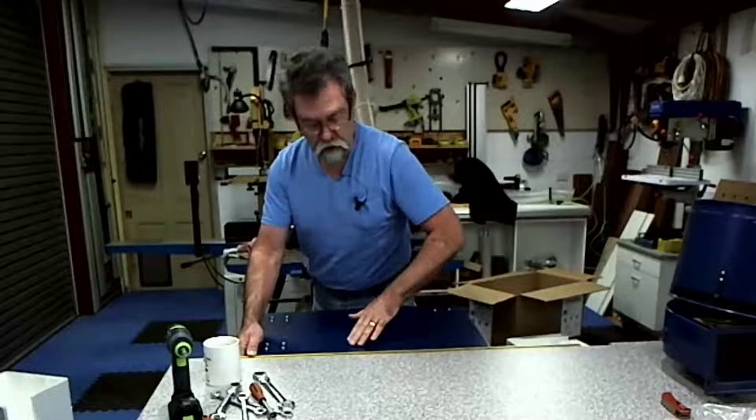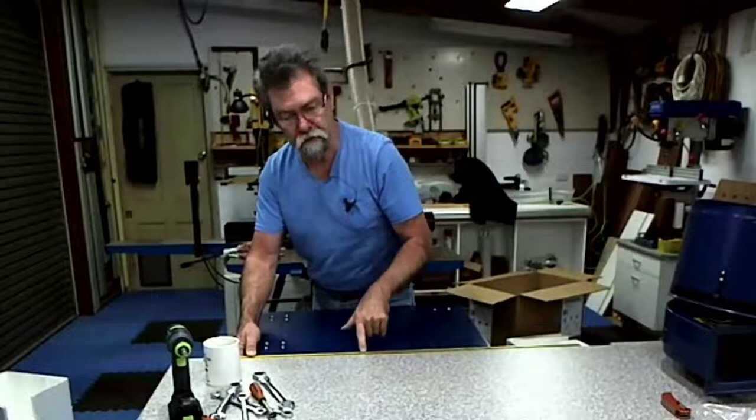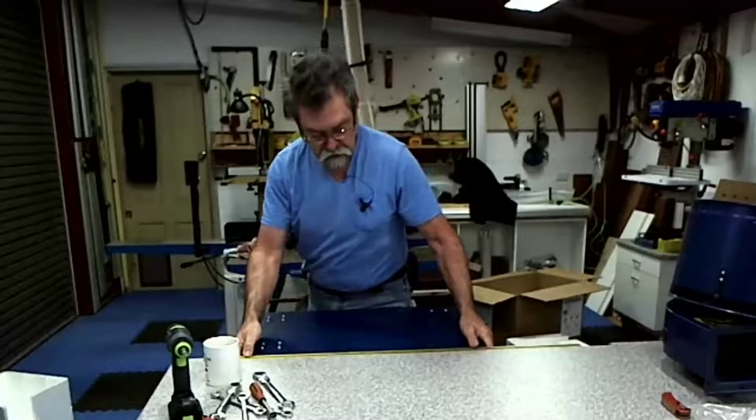So then I push up from underneath, either with a wooden mallet and give it a tap, or I put a piece of timber underneath down onto the floor, and the timber is actually slightly longer than what I want it to be. So I lean the timber out at an angle, and then I tap the timber on the floor coming in. So it's doing this. And it slowly pushes the center up, then I nip them. And then I can get it dead flat, and there's no step there.